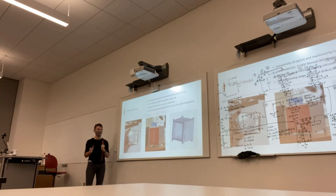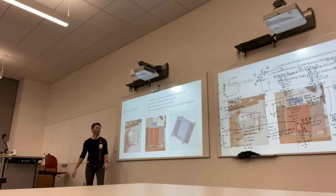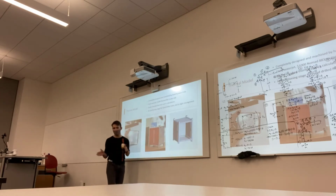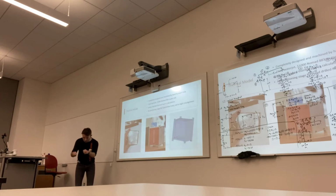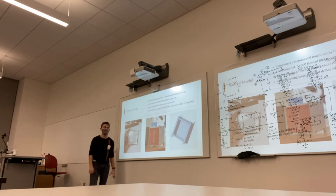The tolerancing was pretty good. If you look at it closely, if you actually pick it up, you'll notice it's slightly tilted. That's primarily because these holes were hand drilled. I didn't have a movable rail to physically displace it, to say, okay, this hole's going to be exactly 3 millimeters to the left, plus or minus 0.1. I literally just went, okay, I'm going to draw a little dot, grab it by my hands, and drill a few holes until it all lines up, as you may see if you look at it closely enough.